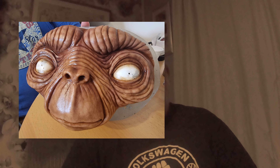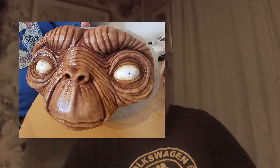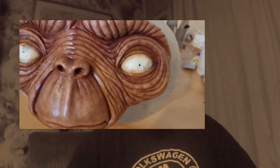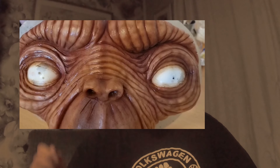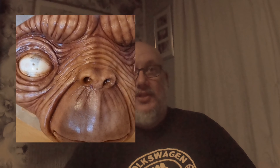Paint is the hardest part for me because I'm not a painter — I can do it but I'm not great at it. The paint itself was made from oil-based paints, caulking silicone, and white spirit mixed together, sprayed through an airbrush. When the white spirit evaporates, the paint and silicone dry as silicone, so once it's on the silicone face it won't come off again.